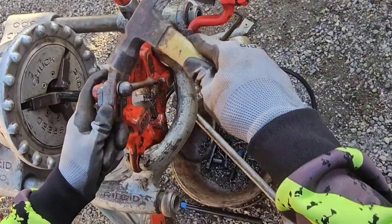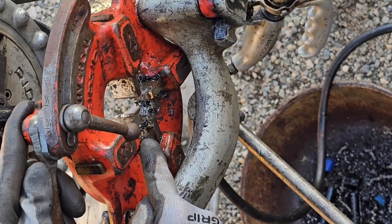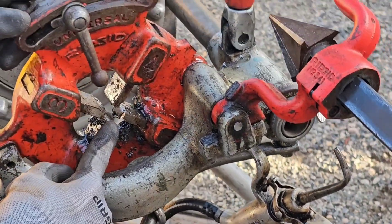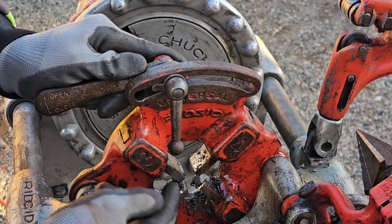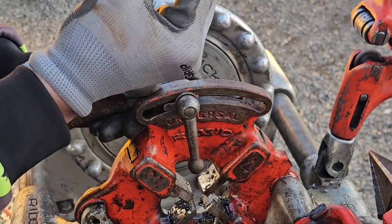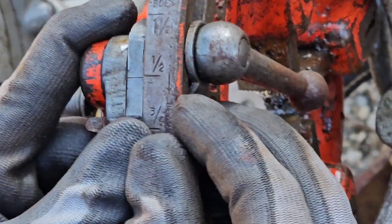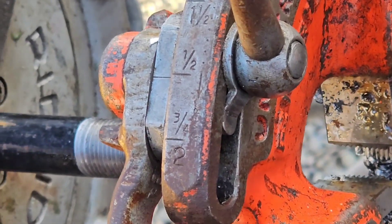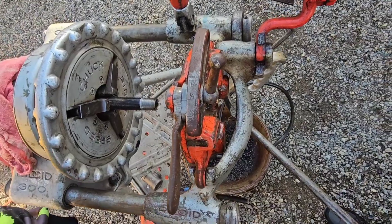If that would have been four I probably would have kept rocking and rolling. If that would have been two and a half I probably would have kept rocking and rolling. But five is too much so we do need to make an adjustment. Loosen it up. We're looking to take less material off now. If I come down here I'm taking less material off; if I go this way I'm taking more material off. I want to be just a smidge less than what was already set. That's about where we were, so I'm going to go just a hair - not much of an adjustment at all. I'm going to send this home just a little bit. Now take a look at it - doesn't that look just a smidge less than it was before?